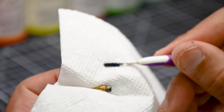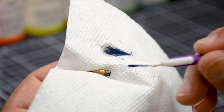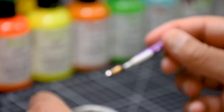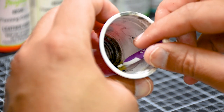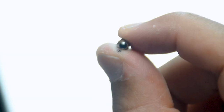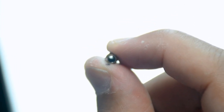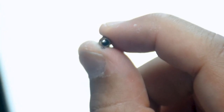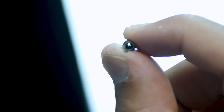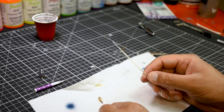You can see how much paint came out — that shows you right here why this nozzle can easily get clogged; there was dried paint in there. I'll dip it back in and go through this process three or four times to make sure the nozzle piece is completely clean. Once cleaned, I like to point it at a white light and squint one eye to see a nice clean circle on the inside. That's your determining factor that the nozzle is all cleaned up.